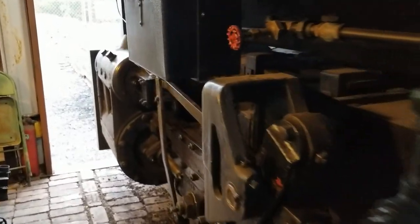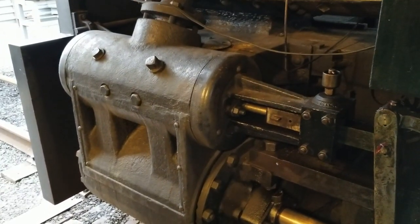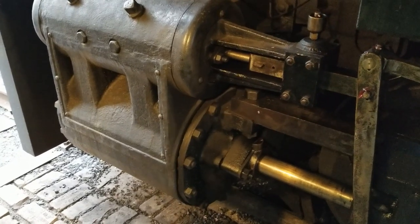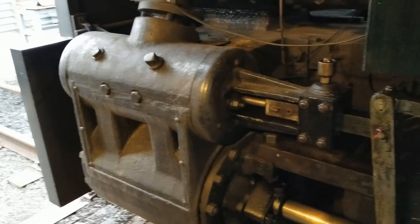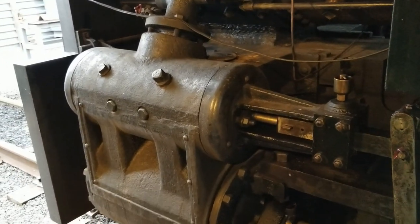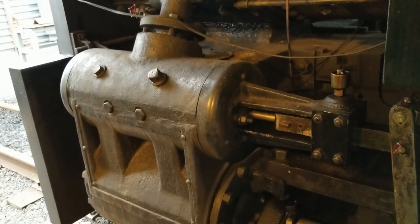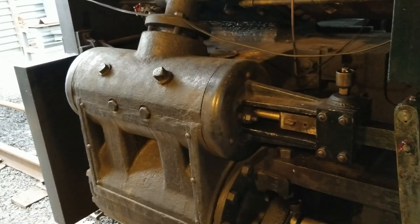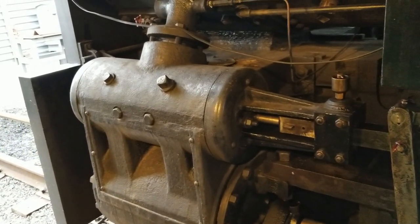Some of the work we're going to do over the winter: you may have noticed in the videos that it has an off-beat exhaust. So we're going to take the cylinders apart and inspect them. We haven't looked at the valves or the cylinders since the engine's been restored. We'll take a look at all that, see the condition, and also set the valves on this — which we never did. When we started running it sounded all right going in reverse up a little 2% grade, but once we started going forward up the big hill, that's where you notice the off-beat exhaust. It's kind of odd that it sounds all right in reverse but not going forward, so we're going to check all that out.